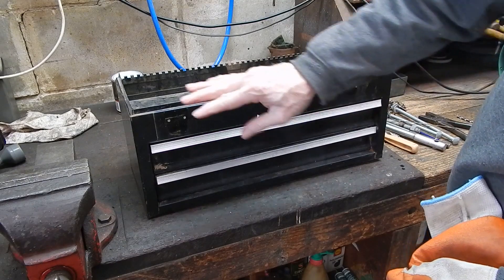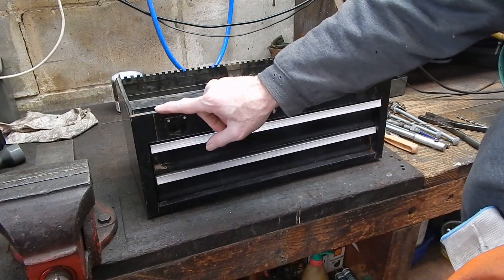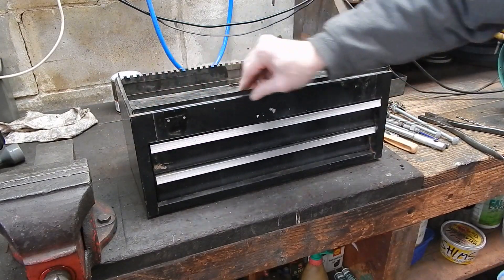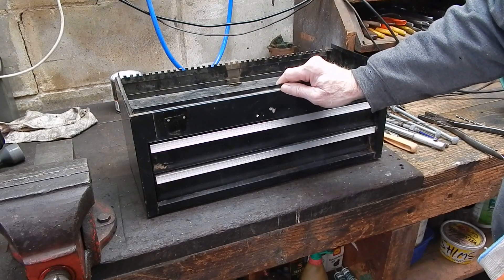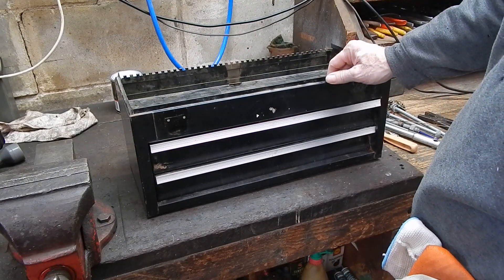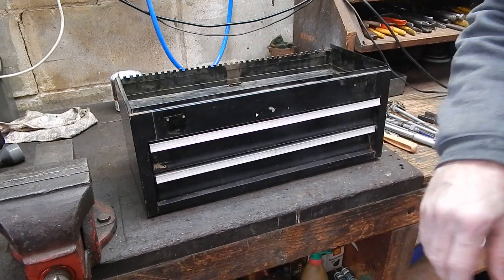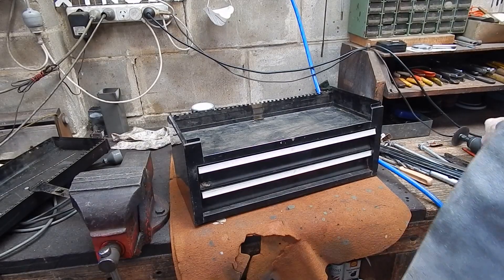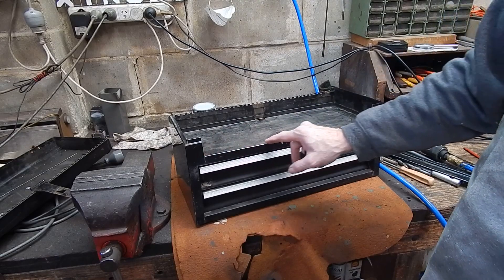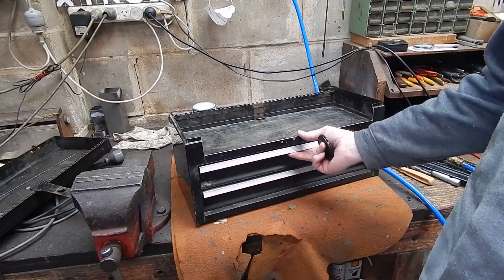The next step, since this is going to go in under the bench, is to cut out sections through here. I'll leave half the depth of the shelf but I'll cut through and along, and that section will come out - that'll allow me to easily reach in and put stuff in and out. To do that I'll use my little air die grinder with a cutting disc in it. A few minutes' work with the air cutter and I've taken that front section out and smoothed off the edges so I don't cut myself. Now I can go under the bench and just put stuff in the shelf area, and I've got the pull-out drawers.